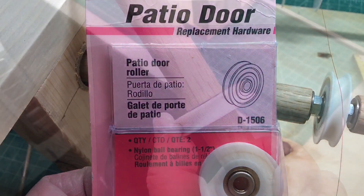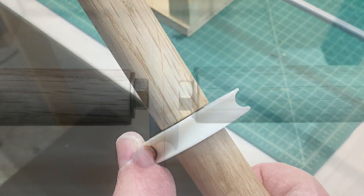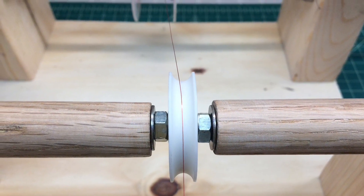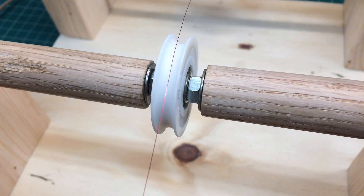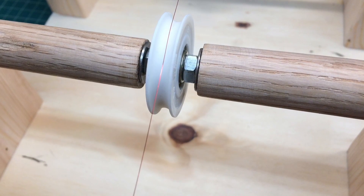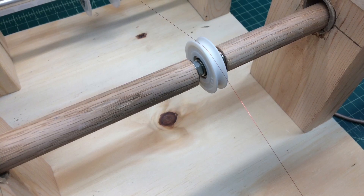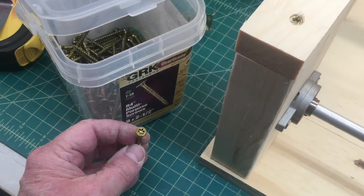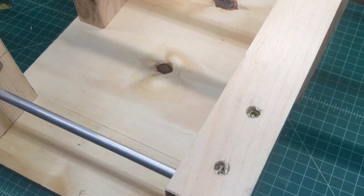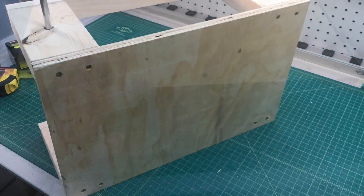This particular nylon roller is so slick that the magnet wire actually just rolls over the top of it rather than making the roller itself turn, because there's not that much pressure on the wire. In the pictures shown, this was my final design for now — if I had it to do over I would probably move this section closer to the receiving bobbin for better accuracy on overlaps. Here I'm just using more leftover decking screws and my impact tool to put everything together.